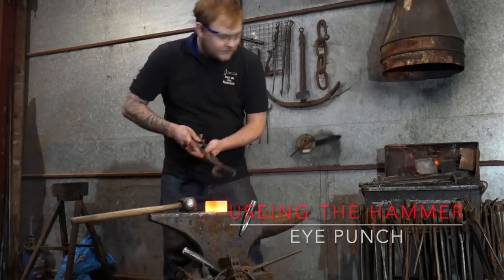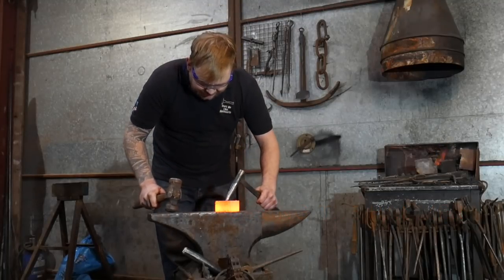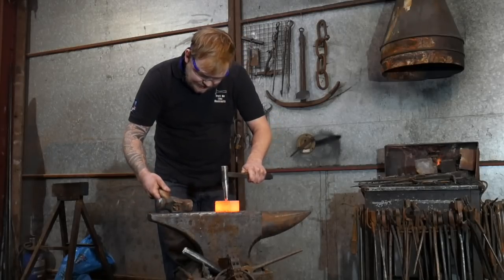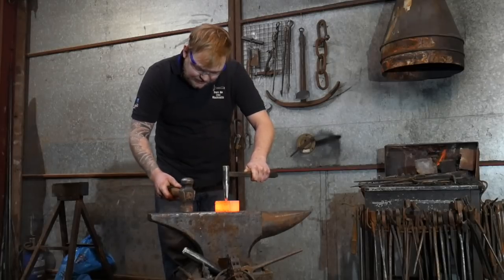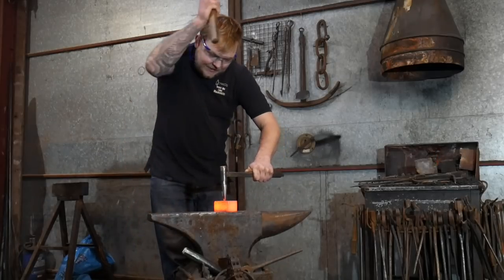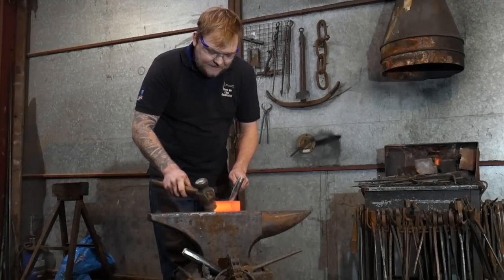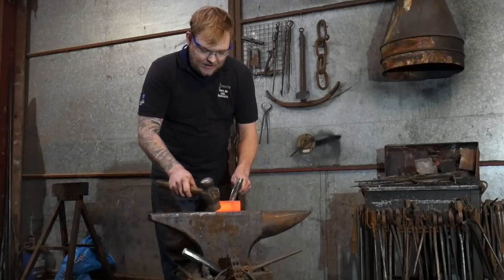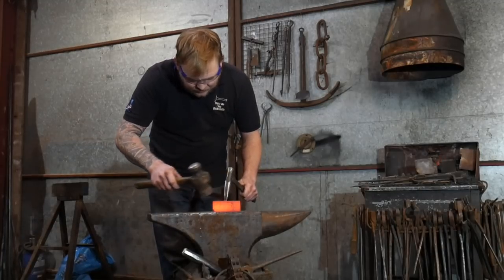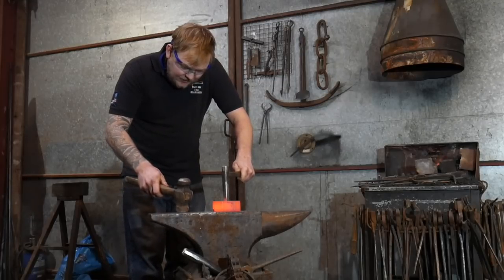So I'm going to take an initial heat and mark the work up. I'm going to make this into a sort of Stanley pattern cross peen, but in my style — slightly offset the hole here. I just want to accurately mark up at this temperature without doing any large amounts of forging. The problem with doing this by yourself without any help is you have to practice that little flip with the hammer and the hammer eye punch, because you can't pick it up with your hands, and putting tooling down to pick up tongs is slow — so that needs practicing too.